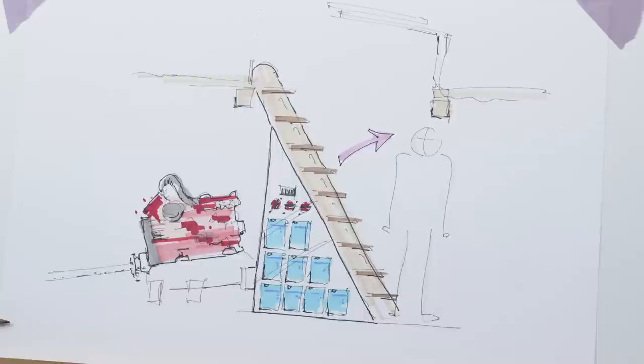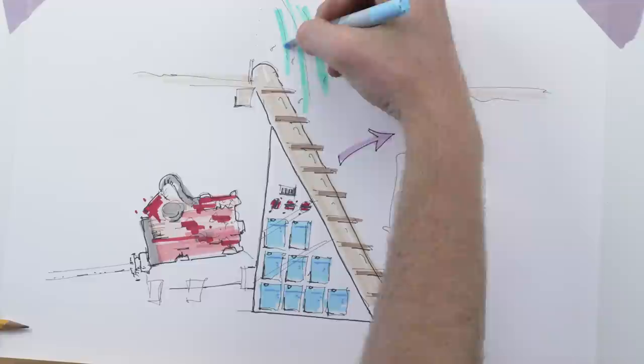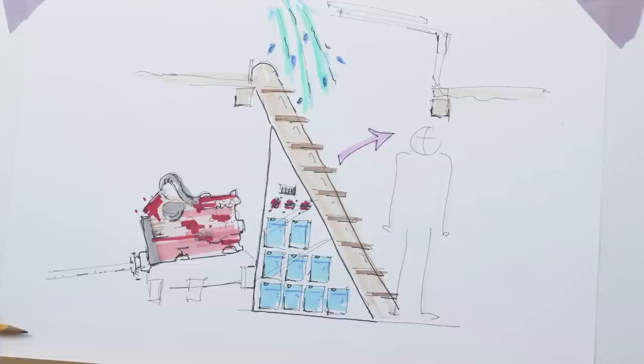The best way to get to these batteries is going to be by actually moving the companionway ladder, the companionway steps, out of the way. Now this gets kind of complicated because whatever door or enclosure is in the companionway steps has to be completely watertight, because it's not uncommon for a wave to come crashing down the companionway, and of course we can't have seawater going all over the batteries and their associated electronics. So I've been designing a locker, a system, a door, a companionway that allows access to the front of the batteries by moving the companionway steps out of the way in such a way that they're kept watertight. And there's enough space for all the batteries under there, and the steps work as steps and you don't bang your head too badly on the beams and hatch above.